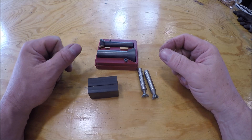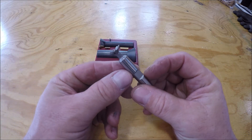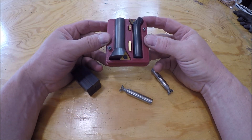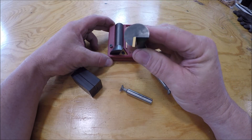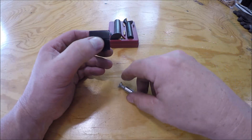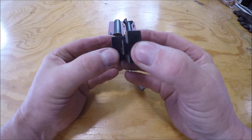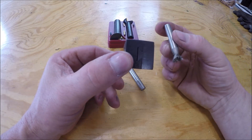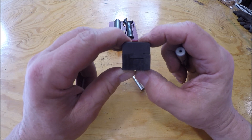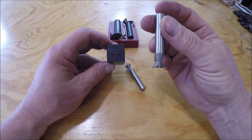Let me bring you up to speed on what I've been doing off camera. I dug through my cutter drawer and found a small half-inch dovetail cutter, 45-degree angle. I would love to use my new Randy Richard dovetail cutter set, but the smallest one in the set is a one-incher, so it's way too big. I took some Delrin and milled a dovetail test cut. But I got on the internet and ordered a 60-degree cutter, because this 45 is not a common angle — 60-degree seems more common, so we'll cut with a 60-degree dovetail instead.